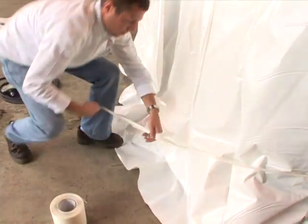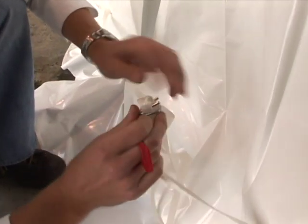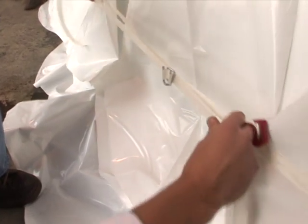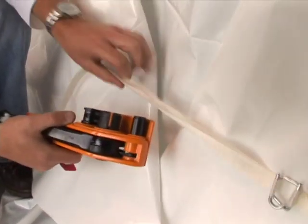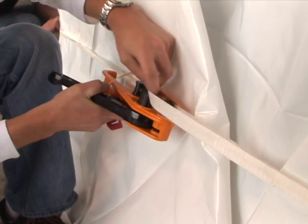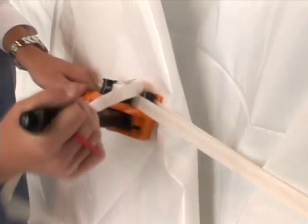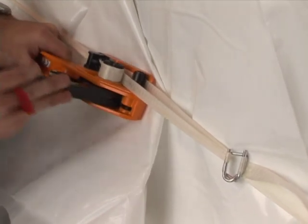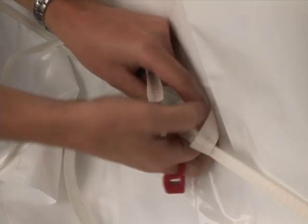That way we can simply cut six inches — have about six inches of material below the band — and then flip it up and make our heat weld. Ryan is installing a buckle just exactly like we did earlier on a boat. The perimeter band is the only thing holding the cover on, so it has to be extremely tight — we're using a tensioning tool. If we can get this as tight as a bow string, that is always helpful. The tensioning tool has a capstan with four slots, and it makes no difference which slots you go into — we just want to make sure the band gets extremely tight.